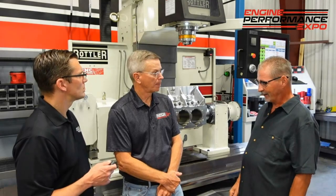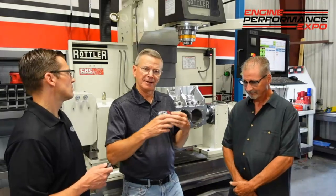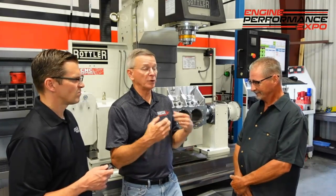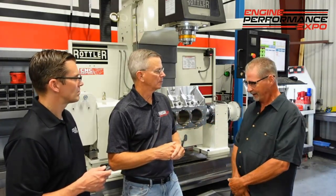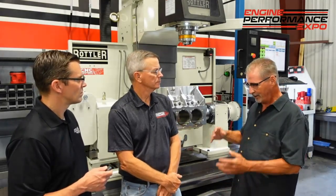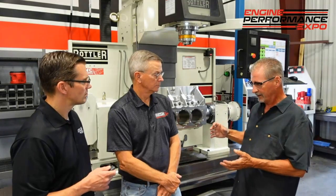When we talk about speed, is it RPM or feed rate? It's both. You actually get the RPMs up as high as you can get them in a lot of applications. Then you drive through and you can feel and see the results. Take that last pass, get down in there, make that tool work. On some applications you'll see sparks — don't be afraid of that. A lot of inserts are really working hard to drive. Would you say most people doing dry machining are going too slow? Probably — about 90%. The tool is so much better now than it was 20 years ago, but people are still running 20-year-old feeds and speeds.